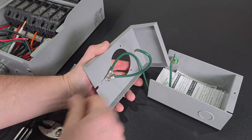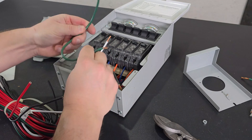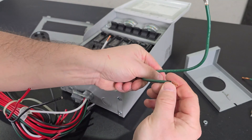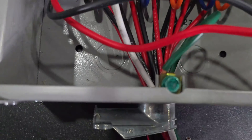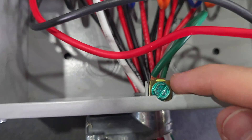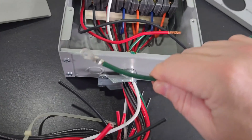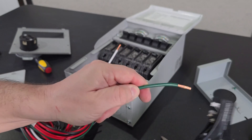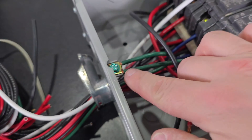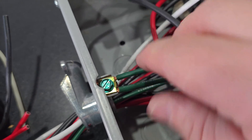We've got to disconnect this ground and we need this ground wire over here — this side's already stripped back for us. I'm just going to put it right into this pin, use the other side and tighten it down, then strip the other side. I'll cut the wire about right there and strip it. I connected the ground right here. I don't love doing this because this is 10 gauge and that's 12 gauge wire.